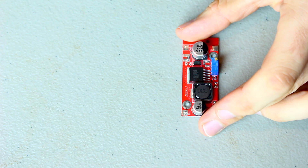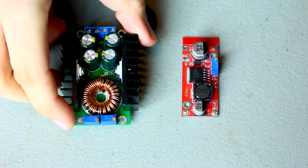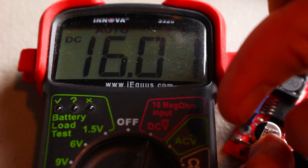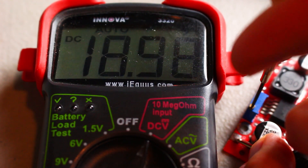What about the other side — what if you need to boost your power up? There's a solution for that as well: they are called boost converters. Boost converters work exactly the way they sound — they increase the voltage. Let's say you only have 3.7 volts from a battery but you need 12 volts. By turning the trim pot on a boost converter, you're able to increase the voltage. This would be useful if you're running a 12-volt LED strip and you only have 5 volts of USB power.